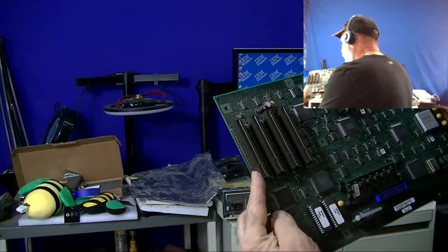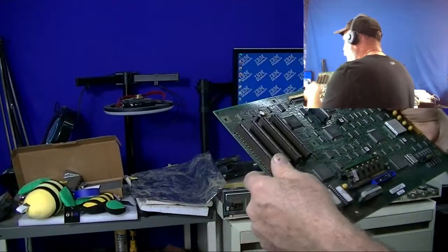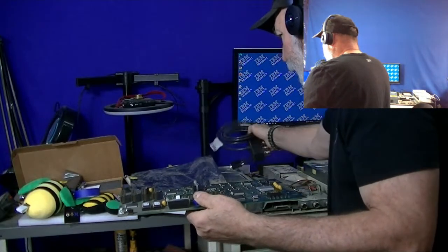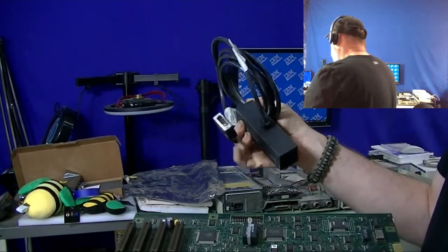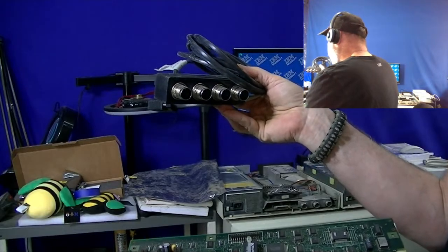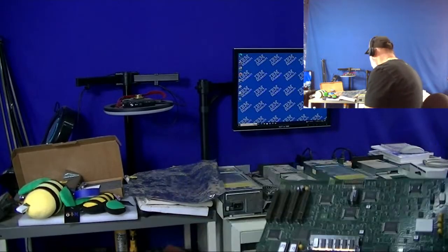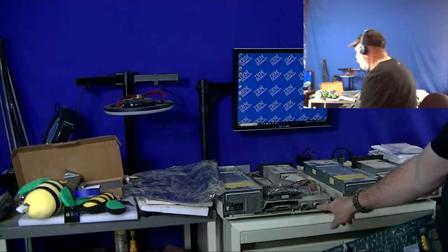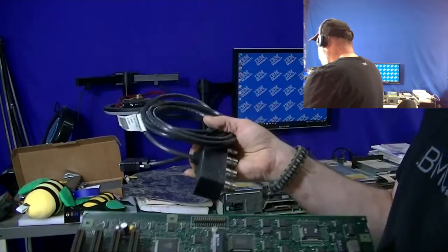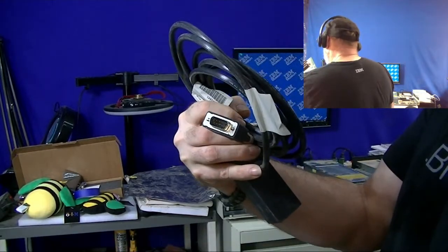And on that 5494 directory, I do have a link to pictures of the Twin-X card there. There's a full-length adapter that this Hydra plugged into. And the AS400s typically had these Hydras with the Twin-X connectors, versus the earlier System 36 and System 34 having the Twin-X connectors directly on the PCB. So a little bit of adaptation to connect on these. This is what ties into the Twin-X adapter that's plugged in here.